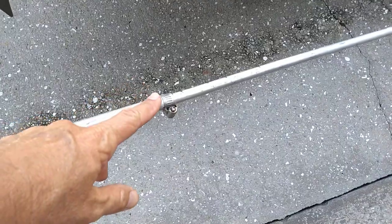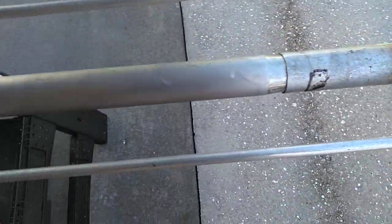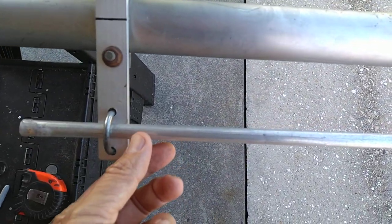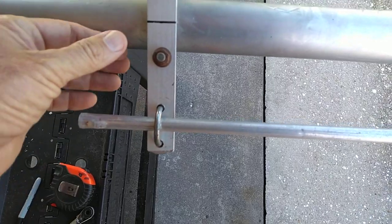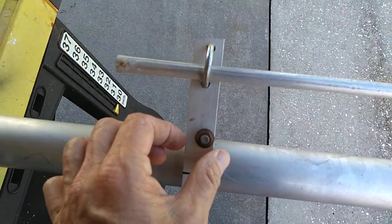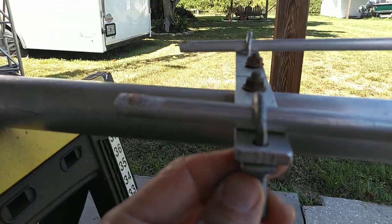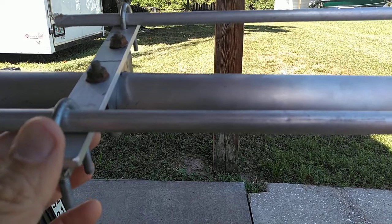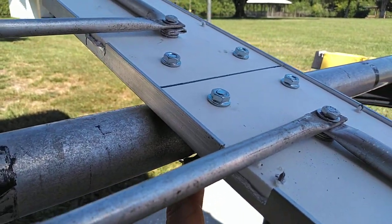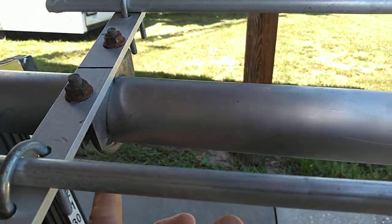You would tune this antenna by lengthening and shortening both sides, as well as these two rods here — I run them back toward the reflector on the beam. You make up a bracket; this is a quarter-inch by one-inch wide flat aluminum. All these things I'm showing you, besides the elements and the mounts, came from Mako.